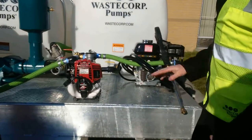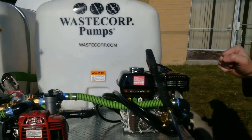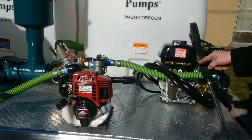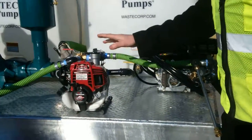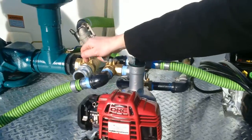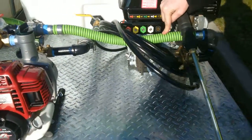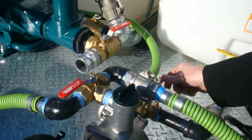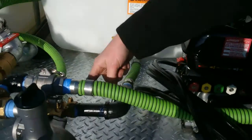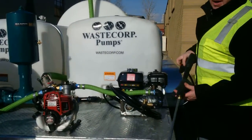Once you're finished with that you can move on to the pressure washer, which is designed to be used with the chemical liquid. For the pressure washer to work correctly it needs head pressure to develop so it can create pressure. With the engine running we're going to divert the discharge line this way — it's no longer going to the reel, all the pressure is going to the pressure washer itself. You also change this valve so it's no longer sucking from the water tank, it's now sucking from the chemical tank. At that point you turn on the engine with the pressure washer and pressure wash whenever you need to.